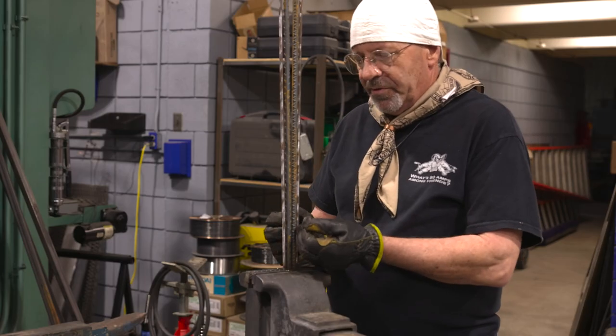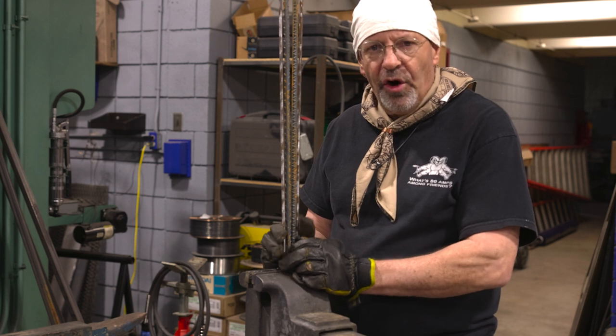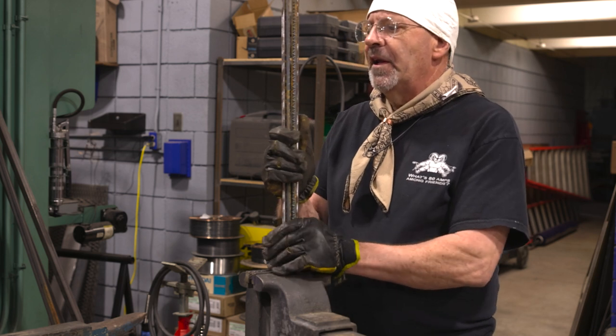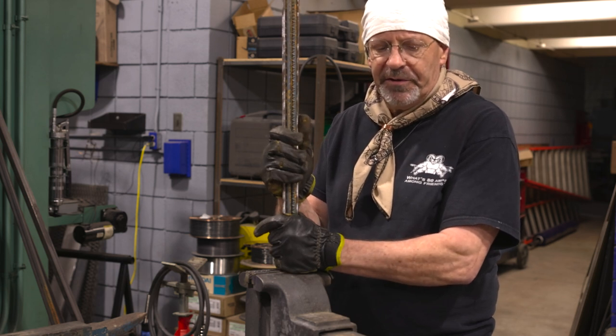I'm heating these rods. The two center ones, I'm gonna go opposite. And then I'm gonna start braiding and lacing these over. The trick is to keep it nice and tight. That's what we wanna do. And then that way we'll be able to make it a nice handle out of it. We'll TIG silicon bronze it into the head that we're making too. So here we go.